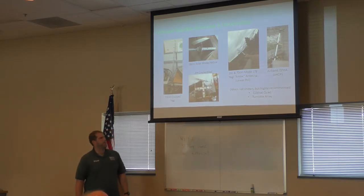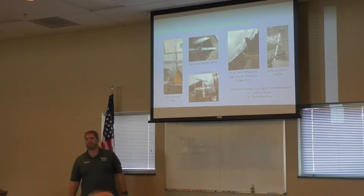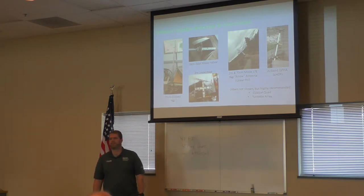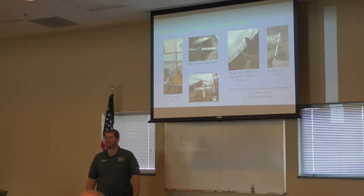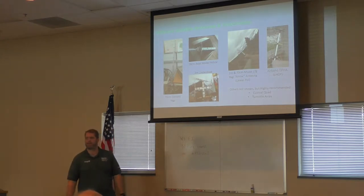One thing that I didn't mention was, well, first of all, the J-pole that Adam was talking about. I had one of those for a number of years. On a higher pass with satellites, your path loss is a lot less. It's kind of like trying to get to the drain on a swimming pool. If you're going to have a race and you can start from anywhere, you're going to move right above it, right? Well, if the satellite's orbit takes the satellite right above you, there's actually a fourth of the path loss in terms of the atmosphere that it has to go through. If you just do the bow tie geometry stuff that we had on the other slide. You can use these lower gain antennas, and the J-pole's got this nice omnidirectional pattern, and it's really easy and forgiving to build, as we've seen.